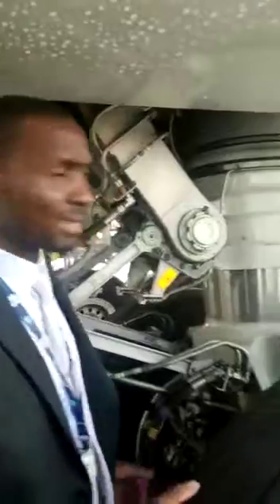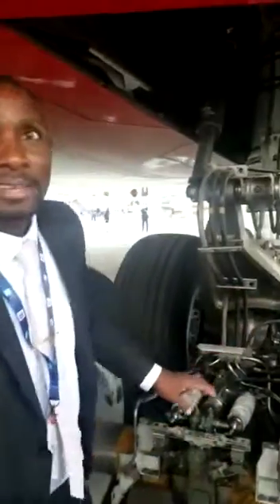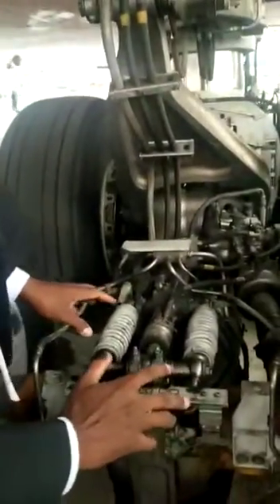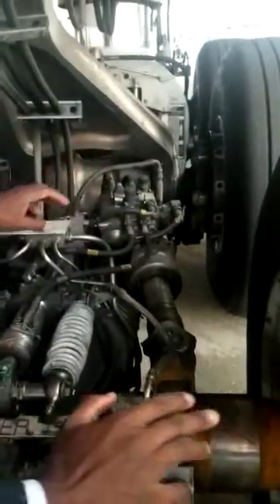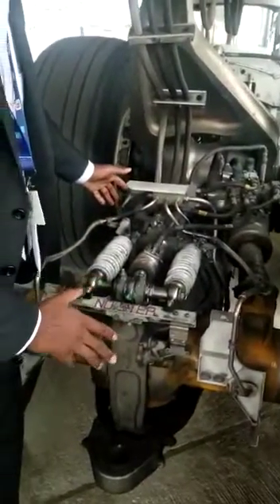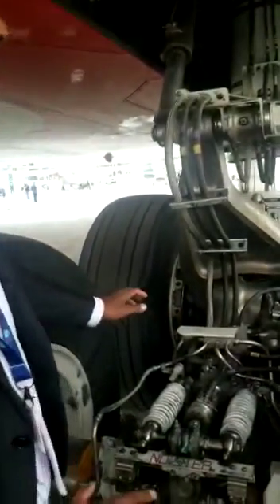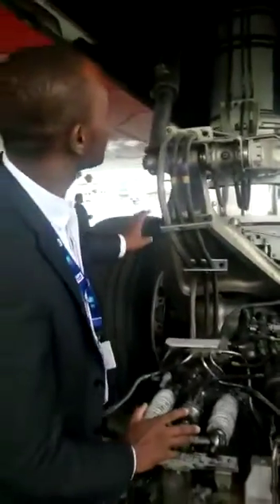Let's look at the body gear steering. The Airbus A380 main landing gear, which is attached to the fuselage, is actually the only main landing gear which has a steering system. The steering helps it to manoeuvre, to avoid skid or slip on the runway. There is also a small computer which helps ensure that all the wheels do not touch the runway at the same time — it touches at an angle. So this is what we have for the Airbus A380 landing gear system.